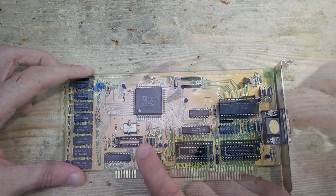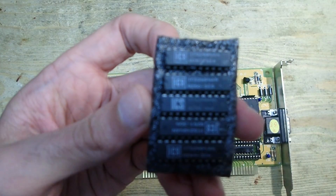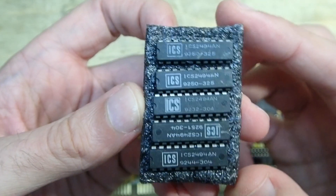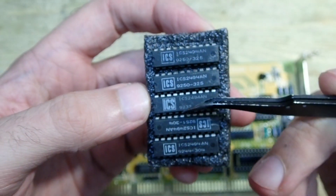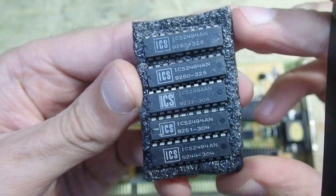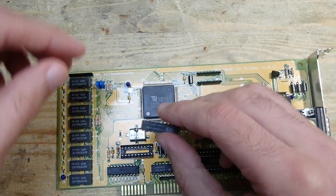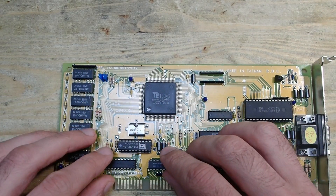Next IC is the clock generator, and just like the RAMDAC, I bought these ICs in China. I got five chips and was glad to see they all look used and old — a strong sign that they are not fake. The date code is from 1992 on all of the chips, which is a plausible date. I would be really disappointed to see, say, 2015 on these ICs. You can see that the logo on one chip looks different compared to the others, but that's okay — the chip with the different logo was made in the 32nd week of 1992 and all others after the 44th week of the same year.